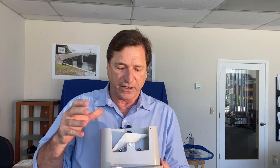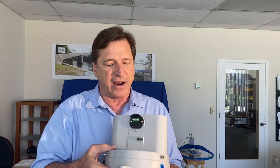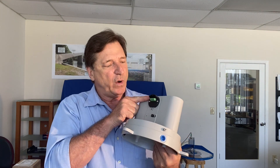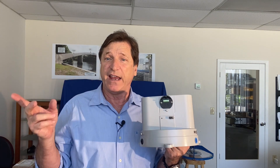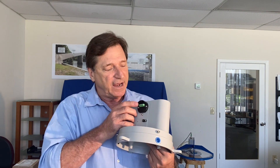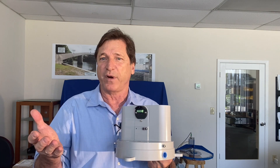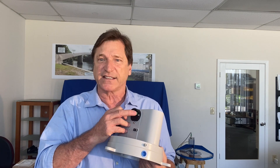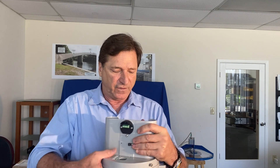That covers the construction, the siphon finger filter, the flow control device, and the bucket. Lastly, I'd like to tell you about our reed switches. These reed switches are quite unique — we have dual reed switches, independent switches that output the same bucket tip and can go to two individual devices. In the field, if a technician finds the gauge is not reporting and doesn't have a spare reed switch, they can simply switch the wires to the other reed and have an operational gauge again. Other customers use these independent reed switches to connect to two separate devices — for example, a radio telemetry system and an onboard data logger, or a SCADA system and a data logger.